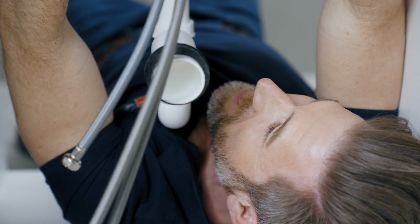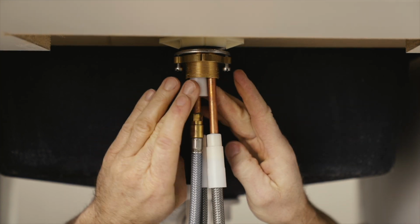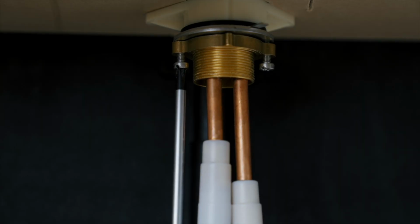Following assembly, make sure that the plastic caps are pushed down as far as they will go. Then tighten the screws manually at first, then tighten very lightly. Now align the faucet and tighten the screws.